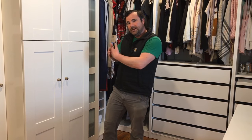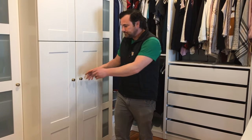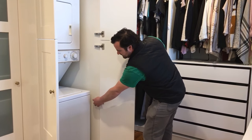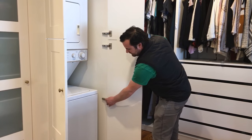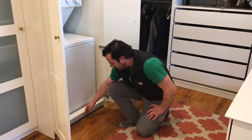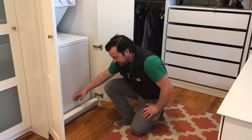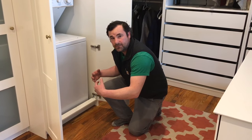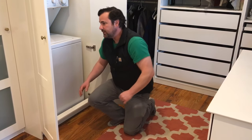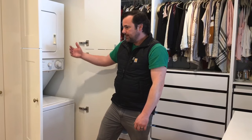For the depth, I went 30 inches deep, because the last time my wife and I did this it was just an inch too narrow. The previous one was so tight I couldn't actually get in behind to pop the hinges off. Down here I have a little toe kick that allows the door to back up onto something, with L-type brackets that I can remove and slide out, so I can pull the washer and dryer out and service it. I need room for the hinges, plus you have the cord, the vent, and everything in behind that needs space.